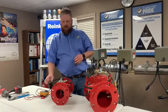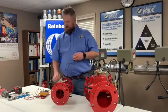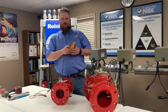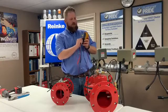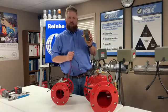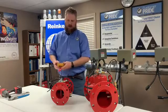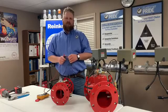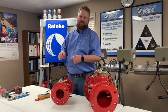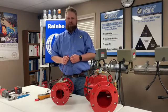Once you've gotten to that point and you've got your Skinner valve isolated with no current or electricity, we're going to go ahead and take our multimeter. All of them have generally the same type of functions. We're going to move it to ohms, and that will allow us to read the ohms on the Skinner valve. Generally these Skinner valves are right around 168 to 180 ohms. Anything below 165 generally means we have a problem with that Skinner valve and it needs to be replaced.